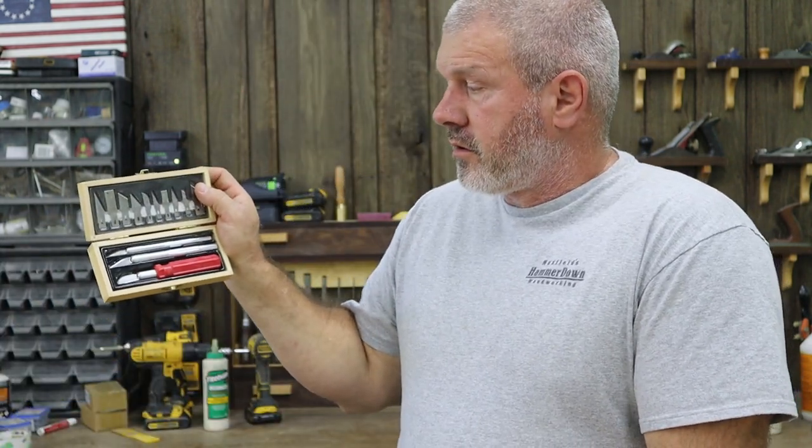For precision cutting, I use a marking knife. This one is a Clark Brothers wooden-handle knife with hardened steel that sharpens well and lasts a good while — I'll leave a link in the description. When precision matters, a good square and a good marking knife is the only way to go. I also keep an assortment of X-Acto knives on hand. I use them when marking joinery — I'll put tape on the wood, mark it, then cut along the tape with the X-Acto knife so I have a clean line without anything to sand off.